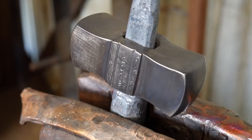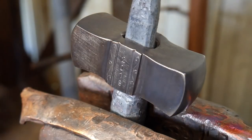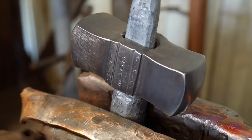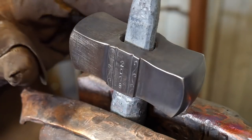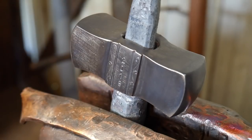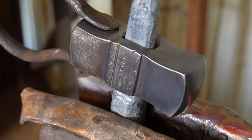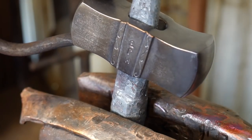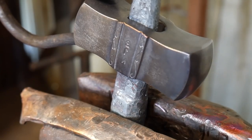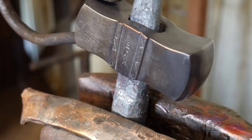I'm not sure if the camera is picking it up, but it has now started to temper. We've gotten that nice golden color — it's run a little bit past and now we're getting that nice golden bronze color out towards the edges of the hammerhead. If the camera isn't picking it up, I'll try to do a finished photo so you can see the way those temper colors actually transpired. Temper colors are based upon oxidization and the way that interacts with lighting, so I'll do my best to get a finished photo of this as-tempered and put it at the end of the video.